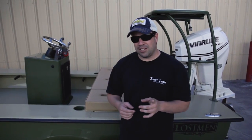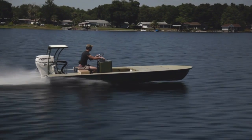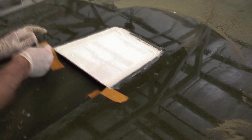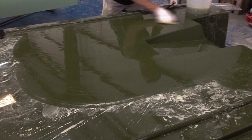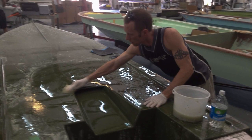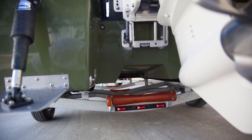The other thing that makes us different is the vented tunnel. We start off by dropping the tunnel in — our tunnel was designed by our customers and us, a collaboration of guys from Texas and the guys from the Bahamas. We give credit where credit is due, but we perfected it by adding a vent to it. What the vent does is you drop the tunnel in, put a flap over it. When you're running, water and air go through, but the air goes back around outside — so it's almost like a trap. You eliminate the air, create more suction, and feed the motor better so you don't have cavitation.